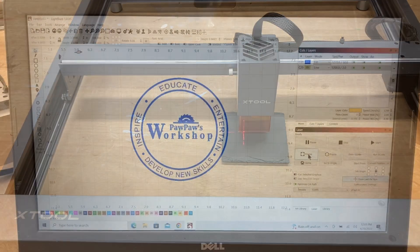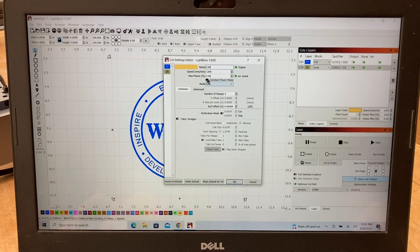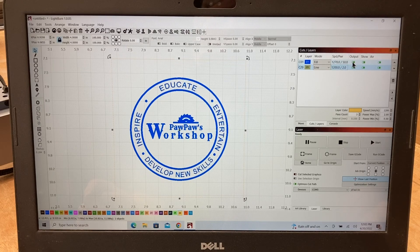There's another way you can do it also — this is a tip I picked up from the Louisiana Hobby Guide and it actually makes sense. I put a square in here and I'm going to highlight it and set it to four inches, which is going to be the size of the tile itself. Then I'll click on this layer and set it to two percent power — really low, about two to two and a half percent. I'm going to do this in three passes. I'll hit OK and turn the output off for the blue fill — I still want the line to be shown as the output.